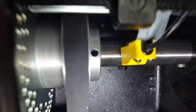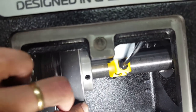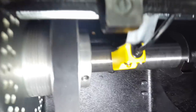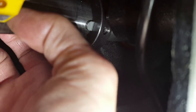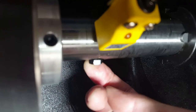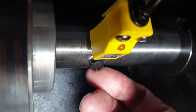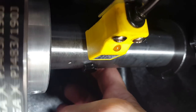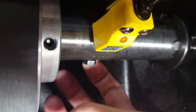So back to the order of operations. You unscrew your pulley set screws off there. Then you come into here and you unscrew that set screw off of your key. Slide that down. Then you have these here, which this little thing here is your RPM reader. There's the screws, so it reads off that. Obviously, that's what that's for. I could be ignorant to what that is, but anyways, that's what I assume. You have to take those out.